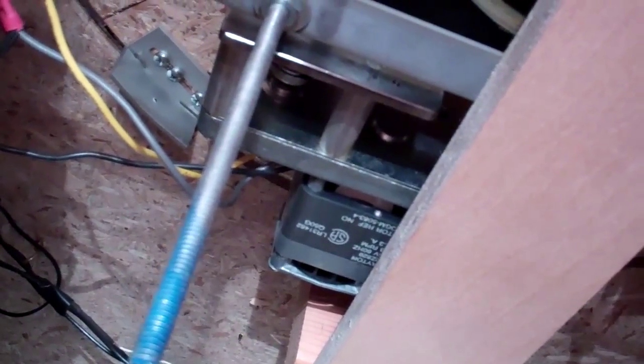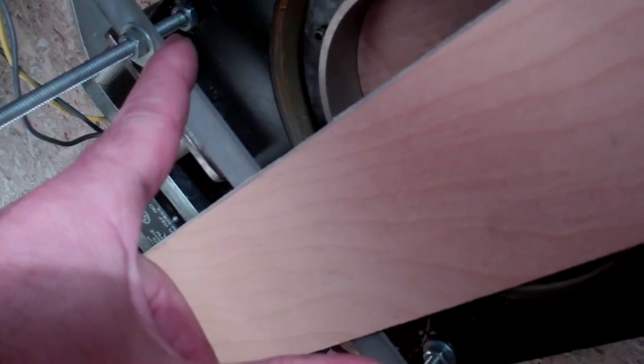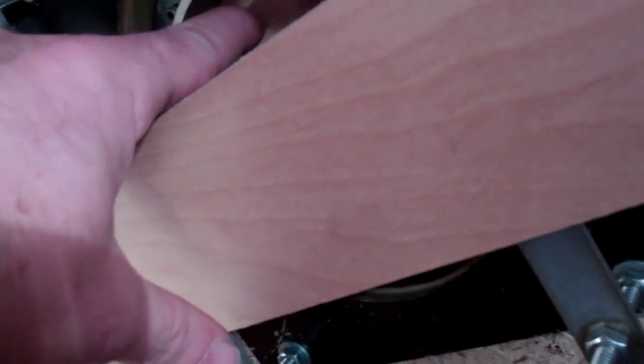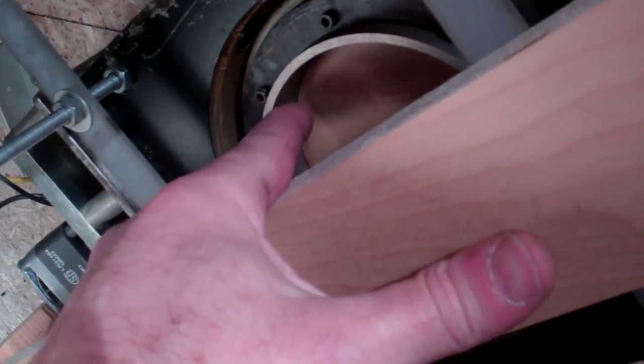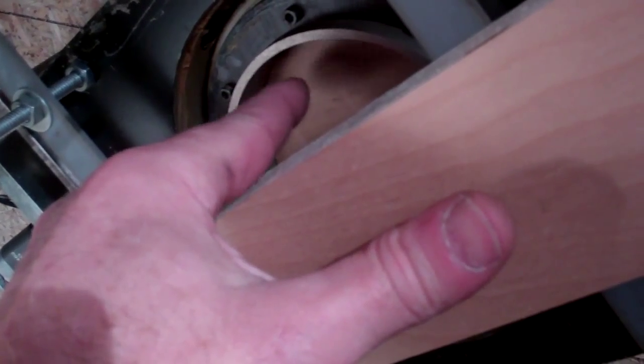This is the motor attached to the drive unit. What it is is a circular piece with a kind of a ring gear on it, and the motor drives a worm gear. The turntable itself just sets into the center of this piece and it slips — you can actually spin the turntable independent of this — so if the turntable ever hangs up you don't do any damage.